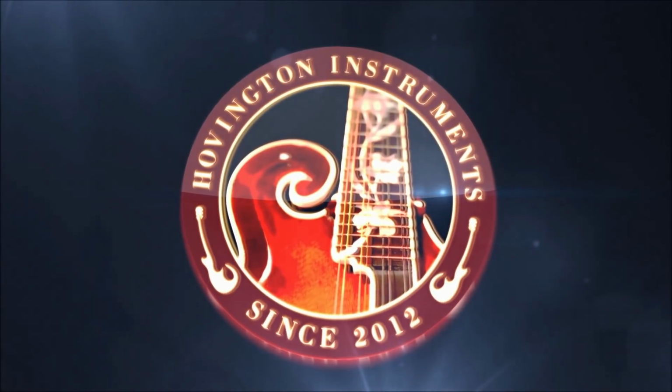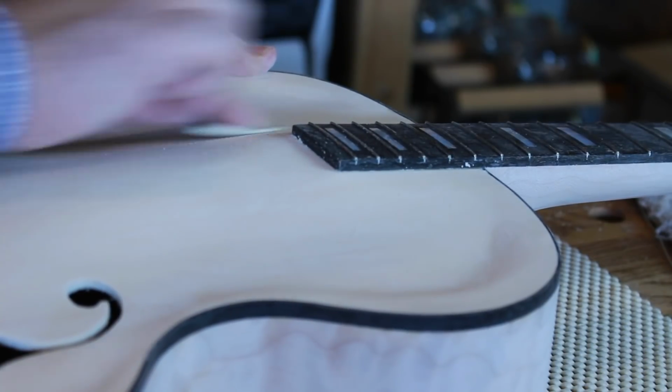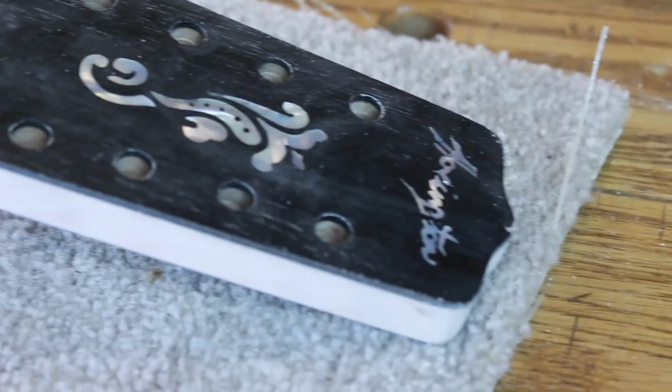So a lot of hours were spent sanding. I spent the time to sand everywhere from 240 all the way up to 600. That makes a lot of dust, and we're going to have to take care of that before we go any further in the finishing process. So here I have a few shots of the Octave Mandolin. I think I was at around 320 at that point.